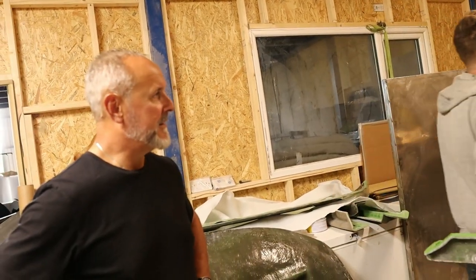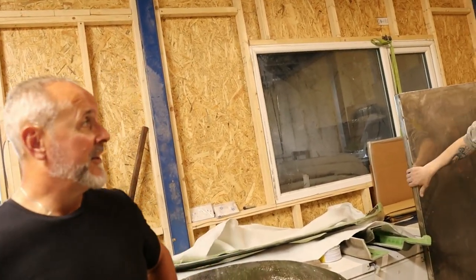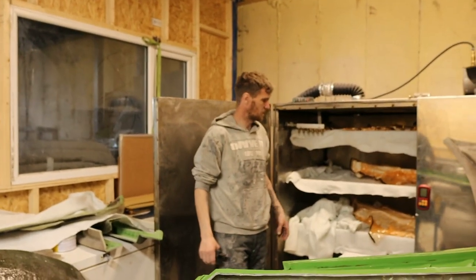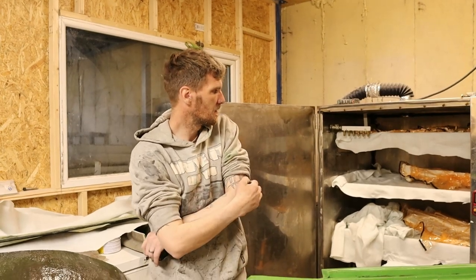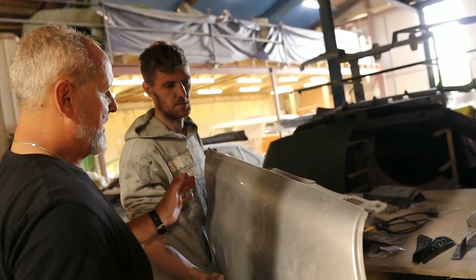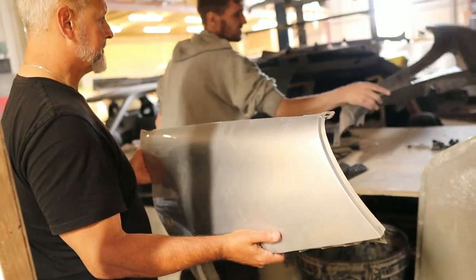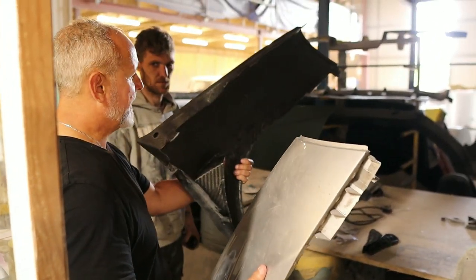The cure cycle is normally about 13 hours. So 13 hours for a group of parts - you can fit a fair bit in there. As soon as that's done you take it out and trim it, then start the process of sanding and lacquering. So this is a standard plastic wing - we modified it, stuck a vent in there - and that's the infused carbon version.